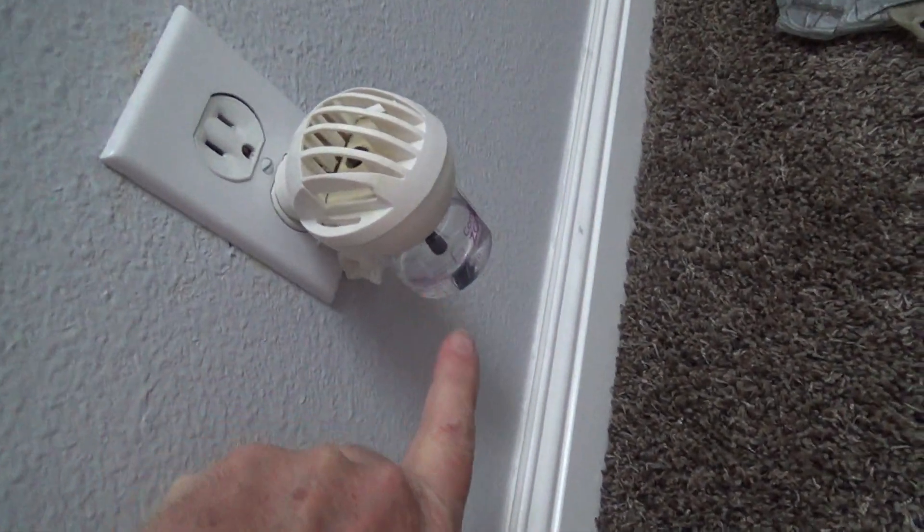There's an interesting little thing on the back. If you really look at it there's more wording — it says 'hot,' 'push to hot.' That means you can push on those to get the wire out, and 'hot' means black — the black wire is always the hot wire. This side little clip connects both of these screws. So if you only have one black wire hooked up, the power is actually going to both sides because this little tab connects this screw to that screw. So it doesn't matter which side — top or bottom — you put the one black wire on.